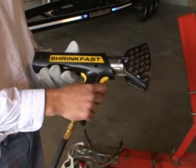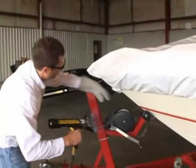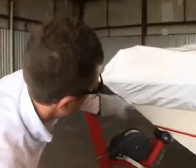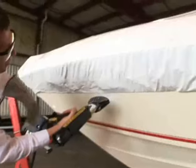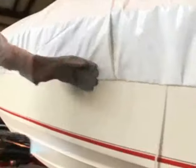Ryan has the entire cover tucked under the perimeter band around the boat. Now it is time to use the heat tool to make a heat weld. We are actually putting a hem in the cover where Ryan will run the heat tool in a horizontal fashion, the flame itself right above the perimeter band. He is using the back of his hand to pat the material, fusing the pieces together so the perimeter band is actually sealed into the base of the cover. You only need a couple of inches of heat weld to make it work well.